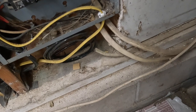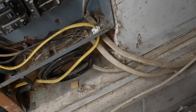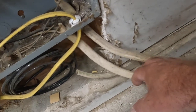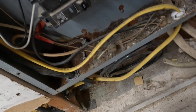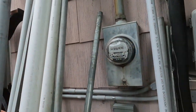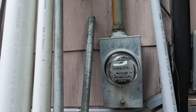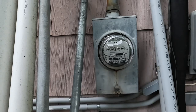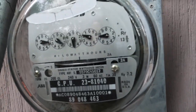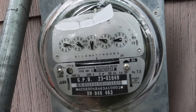The most fascinating thing is the sub panel — somebody did this without any experience. This is an 8/2 on a single pole 40 amp circuit breaker, which is the most ridiculous setup I've ever seen. But that's what powers the sub panel inside our office. Because once I shut off the main breaker, I'm going to undo the meter. And as you can see, with all these electrical appliances and the air conditioning going, it's spinning like a record. So it'll be good to give it a break for a day.